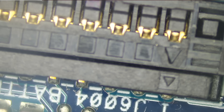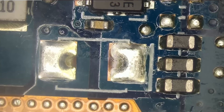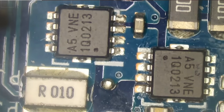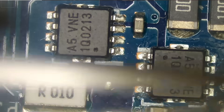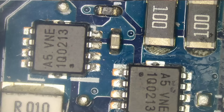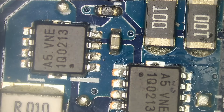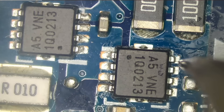If we remove the battery and try to power this laptop on using the charging cable, the laptop will not power on. It will only power on on a charged battery. Let's go near the charging connector right over here. We should have two MOSFETs nearby, right there. These are most likely N-type MOSFETs. Pin number one, two, three are usually the source. Pin number four is the gate, and these four pins here are the drain. The purpose of those two MOSFETs is to protect the circuit, in case maybe you have another charger plugged in where the polarity is opposite — so you do not fry this board.